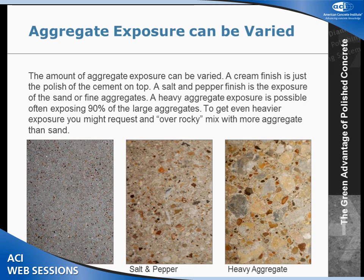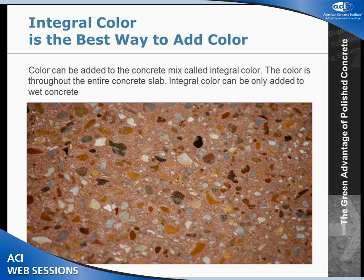Most people think concrete is gray, but actually cement is gray — there are other colors in the concrete that start to expose as we grind. The first thing you see is the sand in the concrete. As you continue to grind down, you see more and more aggregate, creating a very terrazzo-like effect. This pea gravel example shows how we can expose whatever natural aggregate is in the concrete. The oldest project we've ever done was a hundred-year-old building in Amarillo where we exposed aggregate that had probably never been exposed.